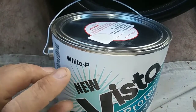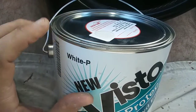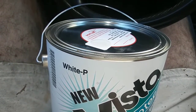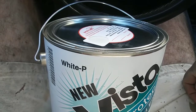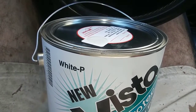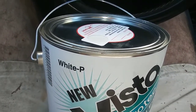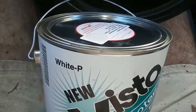Here's how you get your white to cover. If you want a really bright pure white that covers well, have them add KX tint to the white. Usually I'll go with black 0.5 or two increments of raw umber. It still looks pure white - you can't really tell the difference. I usually go to White Shadow, a color that looks white but isn't pure white. If I paint it pure white, before I'm even done with the job, just from walking through and touching the walls, it's going to be dirty.